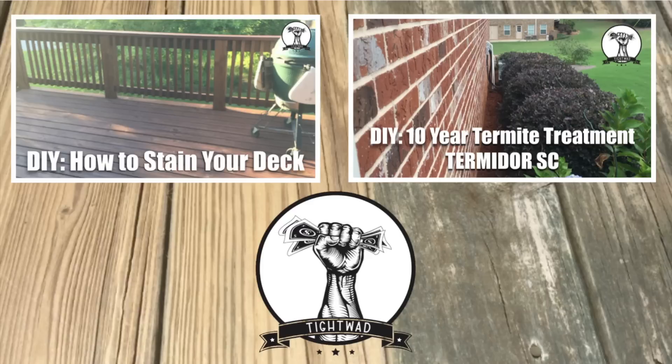There are a few things I learned when trying to prep my deck for staining. The first one is to always make sure you don't hold the pressure washer too close to the wood. This removes the soft wood and leaves the hardwood, which causes ridges. These ridges over time will turn into splinters and will make your deck unsafe to walk on barefoot. Preparing your deck correctly will allow your stain to last a lot longer. Make sure you do the job right the first time. If you found this video helpful, give me a thumbs up and subscribe to my channel. Click the top left video to see how to stain your deck, or the top right to see how I treated my house against termites for up to 10 years using the same chemicals the pros use. Hope you guys have a great day.